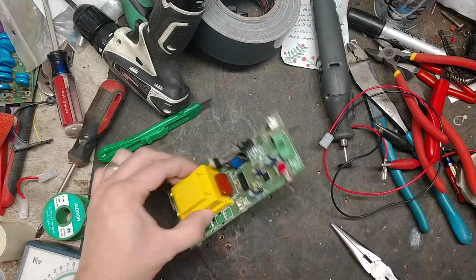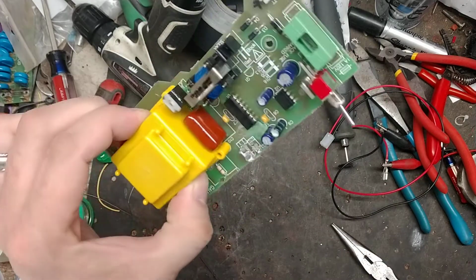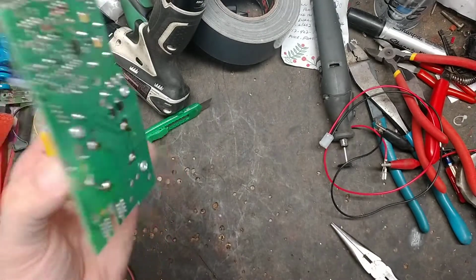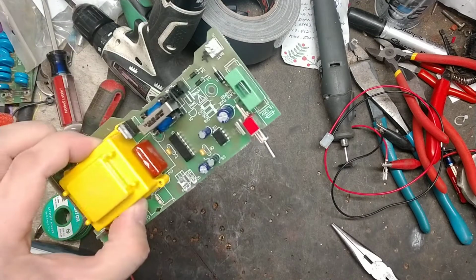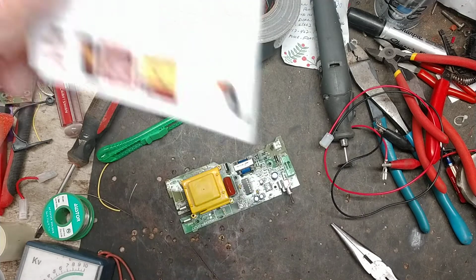The only other thing I could do to it if the customer wanted to is we can change this capacitor out to the next size bigger and still be okay with using their same battery and same solar panel and give a little more joules out of this thing. It doesn't cost a whole lot more to do that, but some people don't care about that. They said, oh, it works fine for what we're doing. So we're going to stop it here.